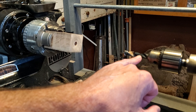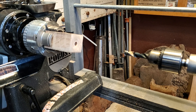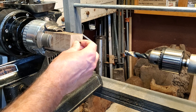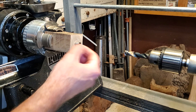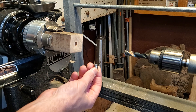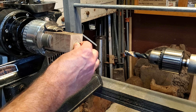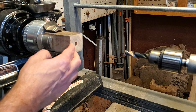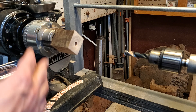There is a slightly bigger drill bit available that gives you a little more room for the glue, but the inserts don't go in that tight — they just kind of fall in there. That works well if you want to put a lot of glue in there, but these ones I actually press in. I put a little bit of glue on it and use the tail stock to press it in — I'll show you that.